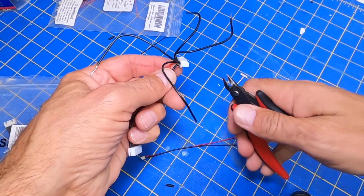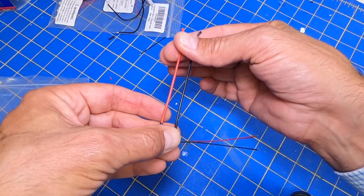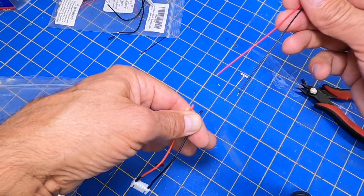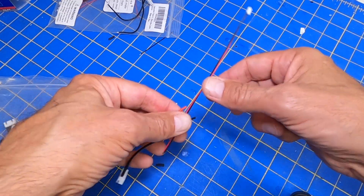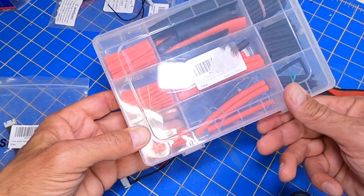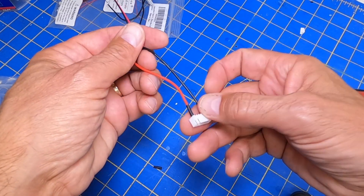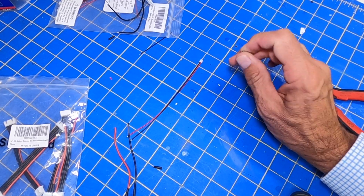You're taking that and that, so now you've got this guy and this. You're going to solder those two sections together and you're good to go as far as this pigtail configuration is set up. You can vary the size if you want — your soldering skills will be needed for this. Highly recommend buying a heat shrink assortment so you have every size you might need. When you put that together, this now is your pigtail: this end goes in the receiver, this connects to your balance plug. If you set up your telemetry right in your radio, you will be getting callouts on your voltage. Good luck.